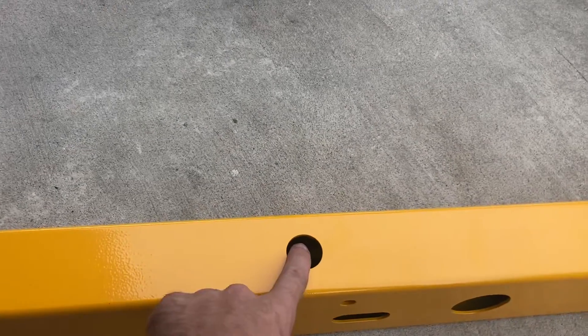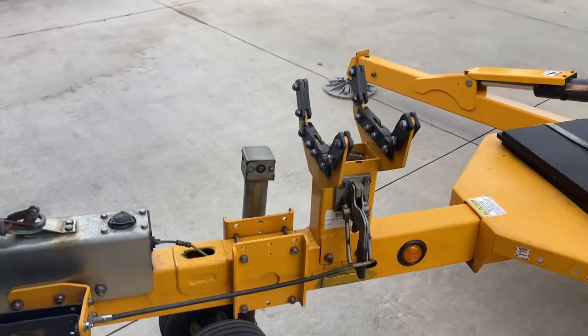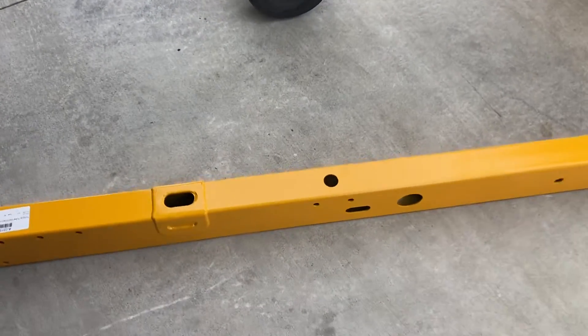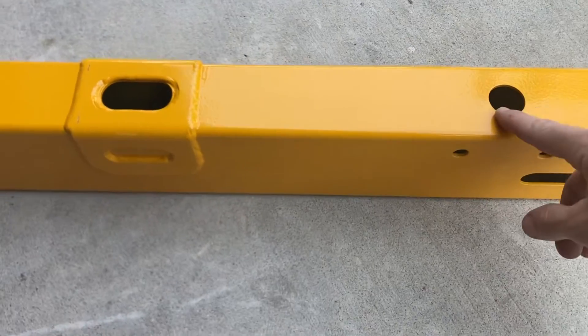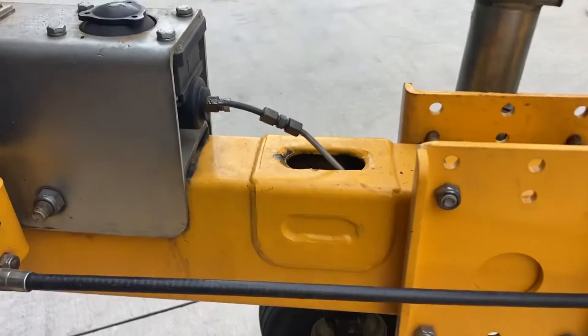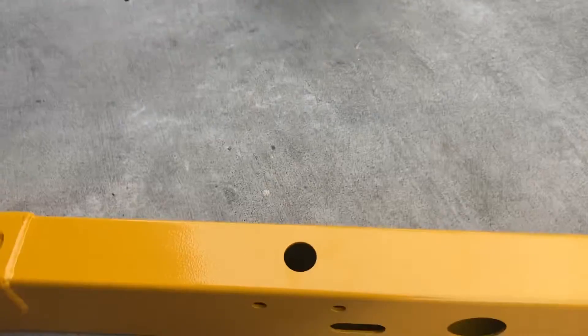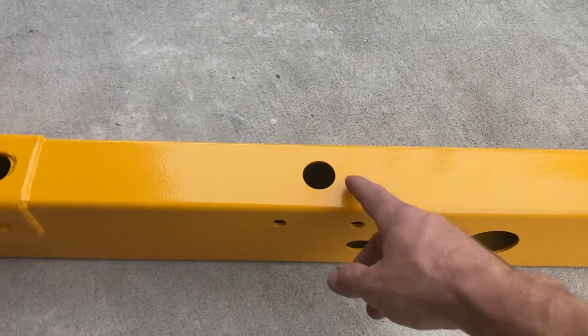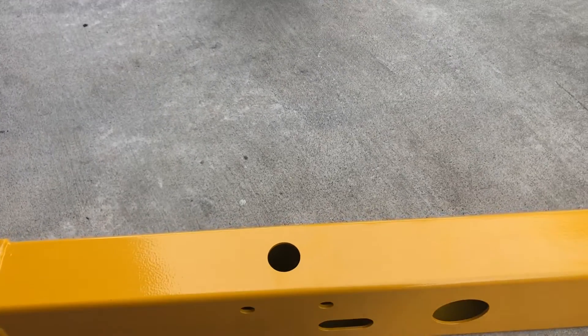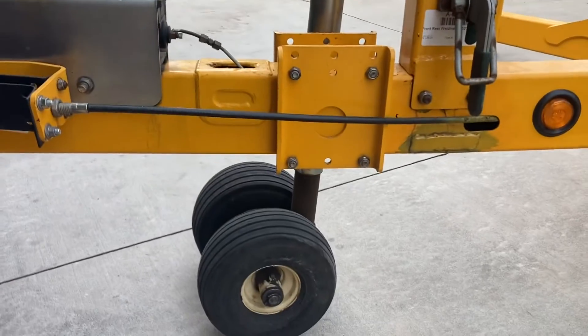Which is the same spot on this one — they've got a hole drilled in here to let the wires come up for those sensors in that lower boom. For some reason this is not reinforced from the factory. I feel like it should be; they've done it here where the brake line comes out, as you'll notice on the front right there. But for some reason they're not doing that here, so we're going to reinforce this one on ours because it is a critical point.